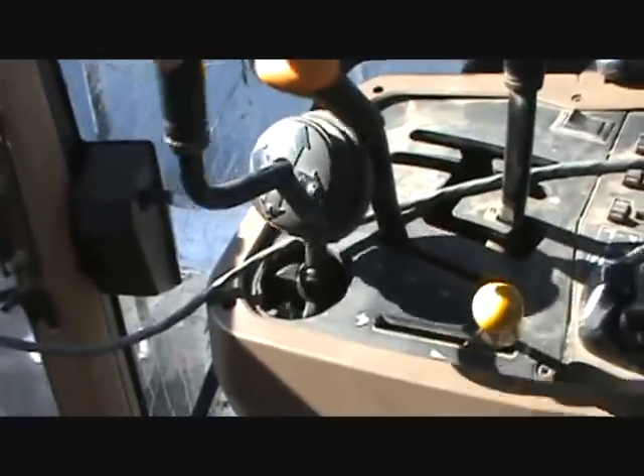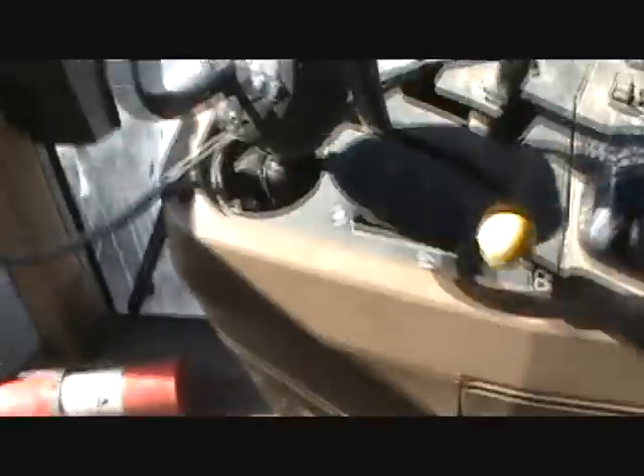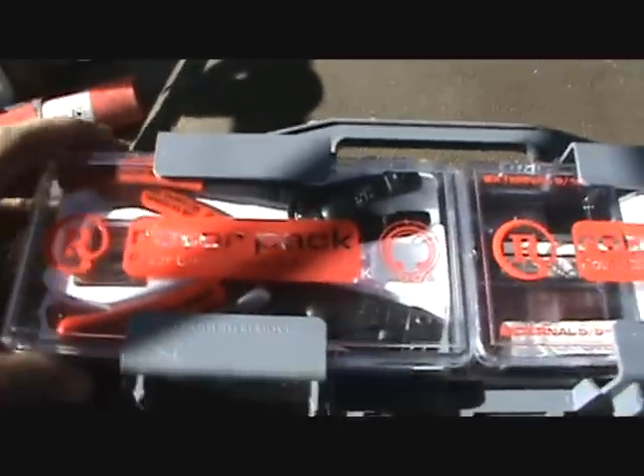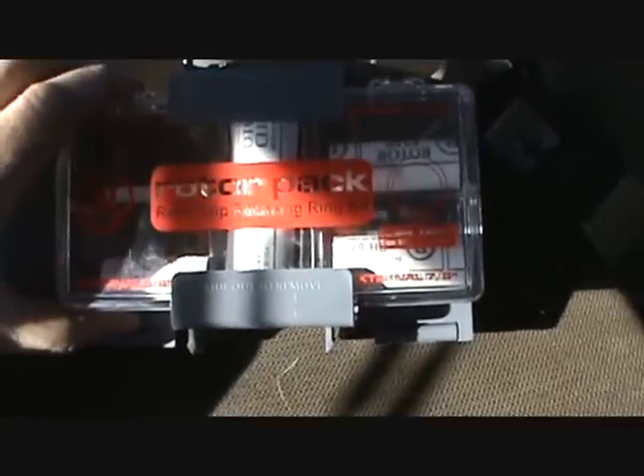The other problem is this joystick. See how it's kind of flopping around there? Right down in there, there's a missing collar. I had an E-clip on it, but the E-clips don't work too well. So I was at a really neat place where I bought that link belt for the 4960 to repair that, and it had this really handy little kit — a Rotor Clip Retaining Ring Kit with internal and external clips. I bought this specifically for this tractor.